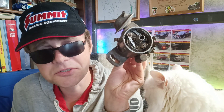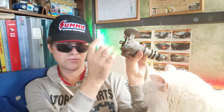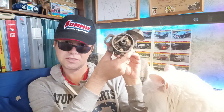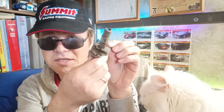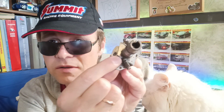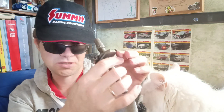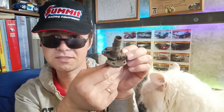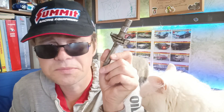You see - if you want to install this old type ignition for your modern car, where can you find a vacuum governor? Here is also the centrifugal advance inside - weights for advancing timing with more speed, adjusting the angle. Here is the ignition shaft. Here are the weights - they shouldn't be worn, they shouldn't be oval. The springs are different, don't get confused with them. So ignition timing advances with higher speed. This is an old mechanical system.